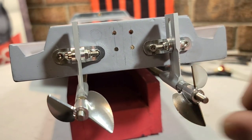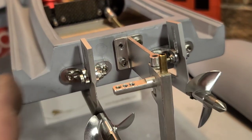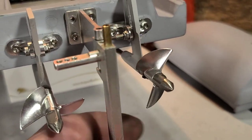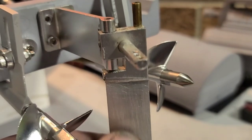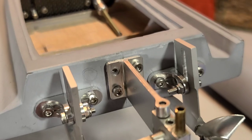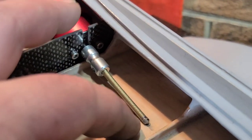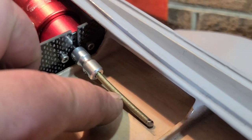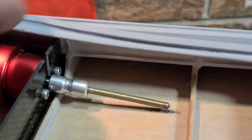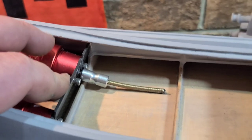When setting up struts and rudder before you drill holes — I failed to mention this earlier — make sure your prop's not going to hit your rudder. Make sure you've got plenty of room. I'm actually working on this rudder, thinning it out and going to shorten it up. We're going to go ahead and drill the stuffing tube hole. I've got these little short pieces of flex cable just to give me a reference for where I want to put my hole — I still need to figure out my angle.